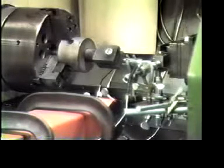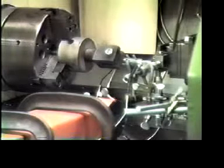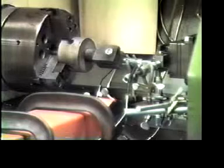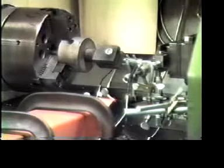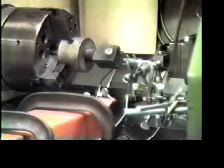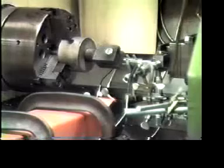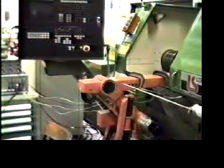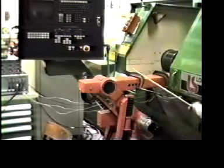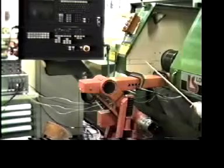And here, we also have a dynamometer to measure the loading force in 3 different directions. That is, the radial direction, the feed direction, and the cutting direction. This way, we can measure all the signals we need to determine the stiffness matrix of the machine tool. This robot arm is used to hold all the 3 sensors we use for deflection measurement.